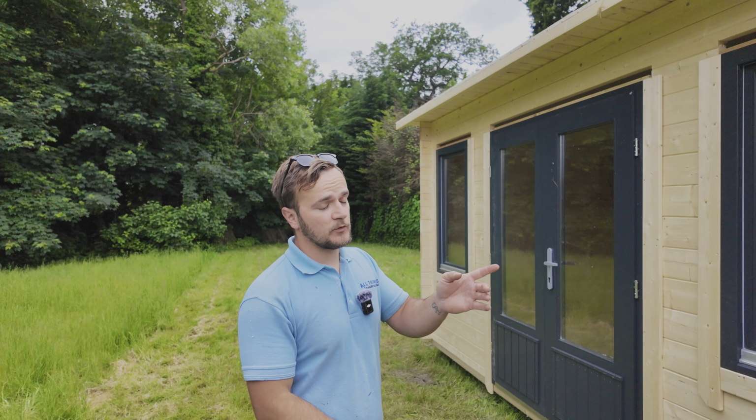Now that you've cleared your roof, it's also a very good time and opportunity to check that you've got no proud fixings like we've got here. Things like that, when you go to put your rubber on the roof, as you're adjusting it and getting it, you know, central or fair overhang the whole way round, just a slight tug could catch on the tip of one of these nails and you could tear your rubber. And that's a very costly mistake to make. So make sure that you've got a hammer to hand, get rid of all of these and you check it all, because they won't honour a replacement rubber if you've torn it yourself.